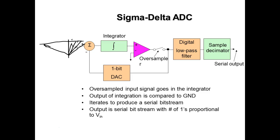So what they do is they take the input and switch it over a capacitor for a certain amount of time, and then they take the analog off that capacitor. And they do it faster than the capacitor can discharge. It generates the slope, and then it starts a counter counting, and depending on the reference voltage, what that capacitor is charged up to, depends on how many counts you get before it stops. And as soon as it crosses zero, that's when it displays whatever's on your counter up to your display on the meter.